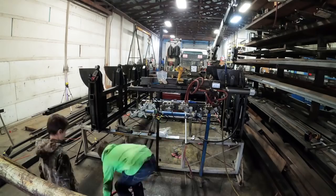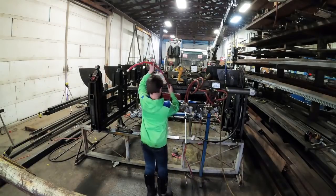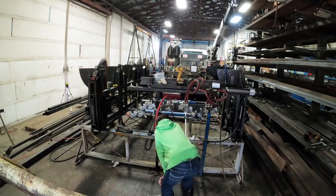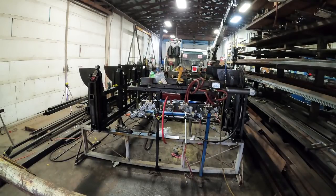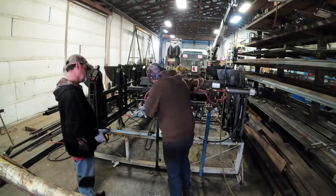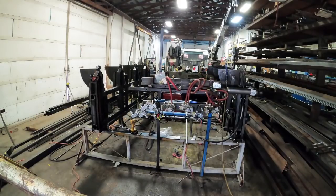I use a regular timer. But this is incorporating five valves: two-way and three-way valves. You can tell the hoses put into the top manifold are exhaust to head out the muffler, and the hoses on the bottom manifold are air coming in to charge the valves. On the left end of the bottom manifold, you see how it sticks out to the left a ways. That'll have the intake hose collar welded on the end of it, where I can screw my hose in, because I got to go through my air filter regulator setup and lubricator setup.